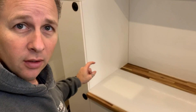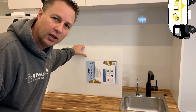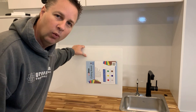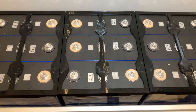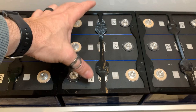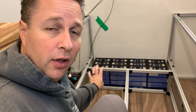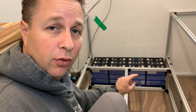While the kitchen may seem like a strange place to work on batteries, it's a good place to steal cutting boards. This half-inch thick cutting board that I got on Amazon — link in the description — is going to be perfect for making sure those batteries can't swell while charging or discharging. And no, I'm not stealing Krista's cutting board. With the cells taped together, the center cell cannot expand outward and the outer cells cannot expand inward, but both outer cells can still expand outward — this is where the cutting board comes in. I'm going to cut one piece for the front and one for the back, and those gaps between the cells happen to fit quarter-inch threaded rod.